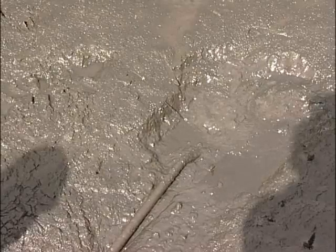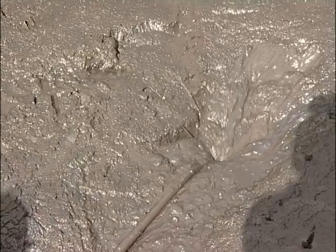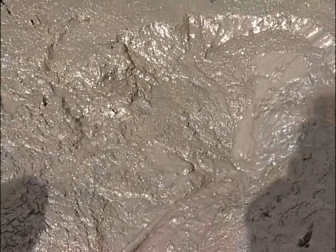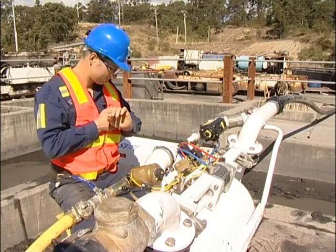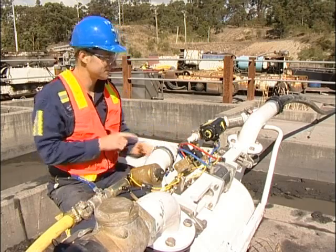If the task and layout permit, the SV60 may run unattended, although SUPAVAC recommends regular operational checks are carried out during this period. Always use a watch to check the timers. The numbers on the timer dial are a guide only.